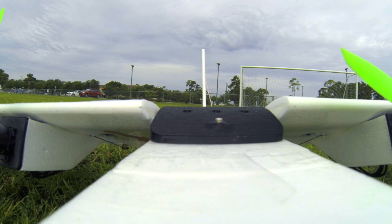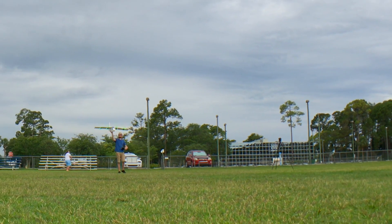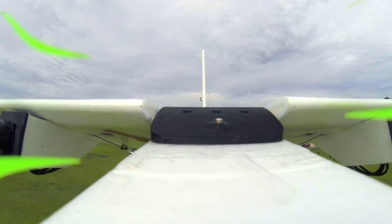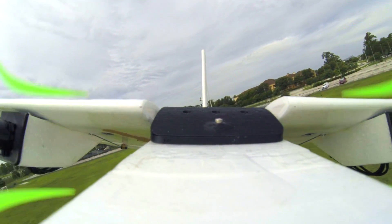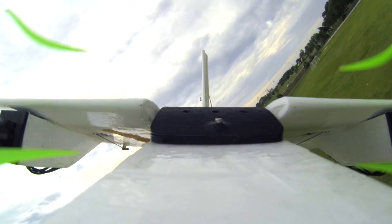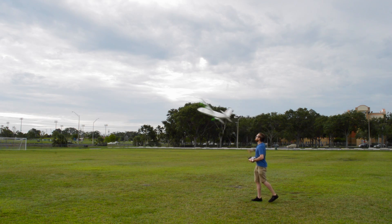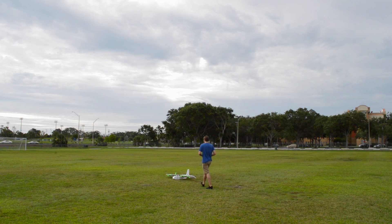But I couldn't get it to turn at all — it's really unstable! What was happening was the fuselage wanted to be level with the air, because it does have some drag too, and the wings also wanted to be level with the oncoming air, so they were constantly fighting, and the plane was just pitching and bucking back and forth, so I couldn't really apply too much power. And also it was kind of just tip stalling in the turns, because the plane was constantly flying at a high angle of attack, so it was constantly almost stalling. I would get it into a turn, but it would lose too much altitude and I wouldn't be able to get it around the corner. And then on the third launch, I had one of my ESC wires unplug itself, and yeah, this happened. So definitely check if all your motors are running.